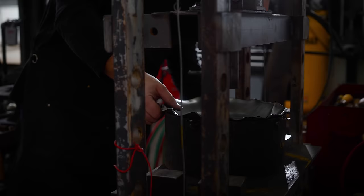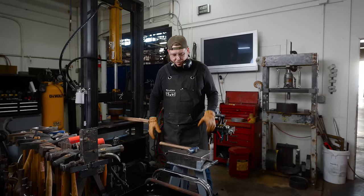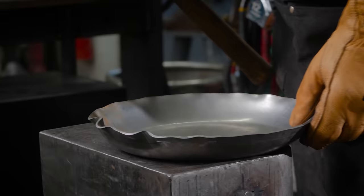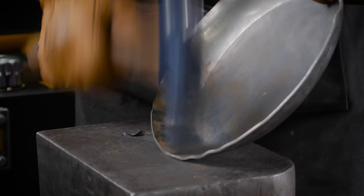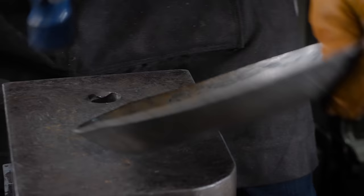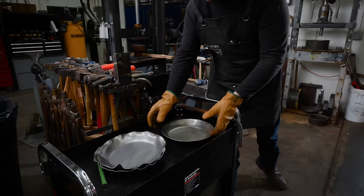The CNC plasma cutter and hydraulic press — those are the two biggest pieces of technology that we use here. For the most part, everything else is the same way you'd be doing it hundreds of years ago. The next step, now that we've done the initial pressing on these skillets, is we need to take care of these wrinkles — you can see these form as we press them out. We call these little marks birthmarks because they're just part of the process of this pan being born. Now that's a round skillet, basically done before it goes to have the edges ground and go off for finishing.